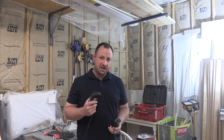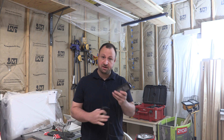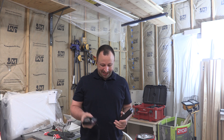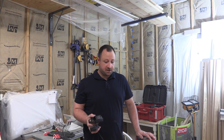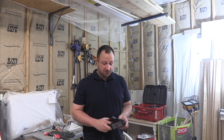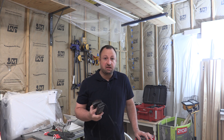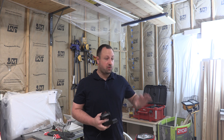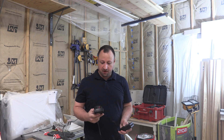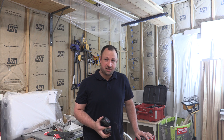This was a fun project. We were able to validate that we can take an existing Milwaukee battery — an aftermarket one, or one that doesn't work anymore — and combine it with a notebook charger, in this case a 4.5-amp 90-watt AC adapter, to turn it into something that lets you connect M18 tools to mains power. We'll make this more hardened, add capacitors, and may try a 120 or 180-watt Lenovo supply to run heavier tools. Make sure you're subscribed so you can see the capacitor upgrade. Thanks for watching, and check back soon.